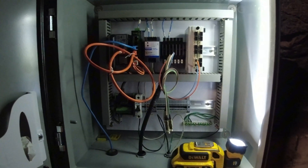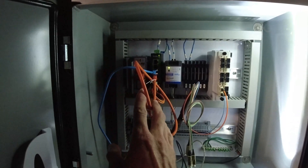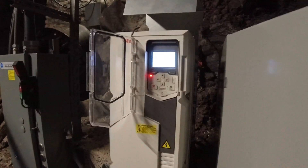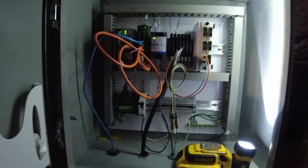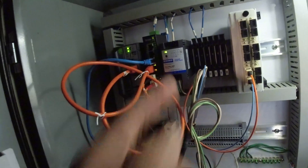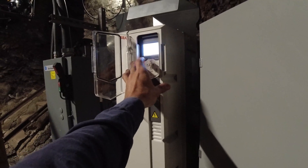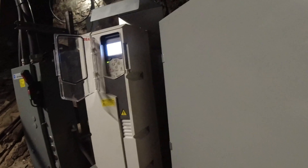First step: reset the breaker. There it goes - PLC is waking up, doing its blinking light routine. That fault should clear on our VFD - it may be a lockout fault I have to reset. It's showing comms now, and it's showing transmit and receive on the fiber. Let's try reset - I have it in local so in theory it shouldn't take off and run away, but it always could surprise me. Now if I put it in remote, we should get it to take off.